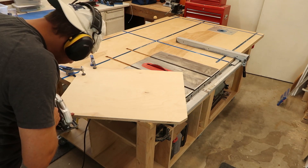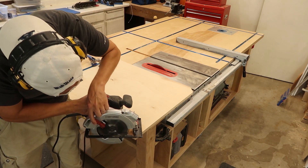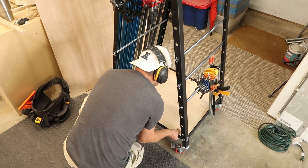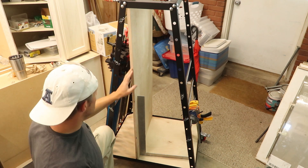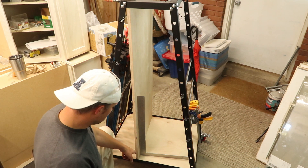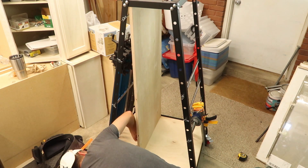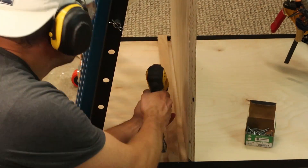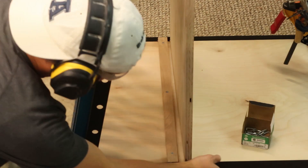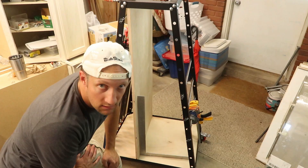I had to cut the corners on the base piece because of all the bolts in the corners, so I could sit it in without it bumping into them. I got the vertical piece in and the base in place. Now I'm going to square this up, make a mark on both sides, then put a backboard or two-by-four back here that I can screw this to, get that in place, and then we can hang the dust collector.